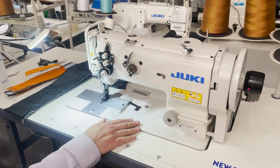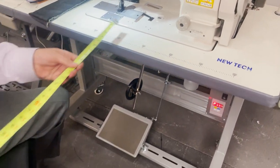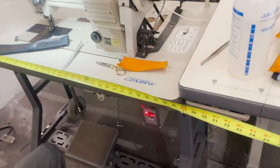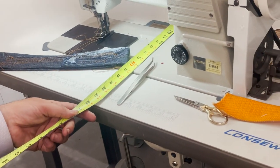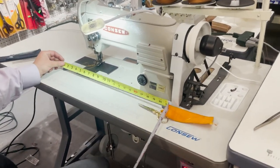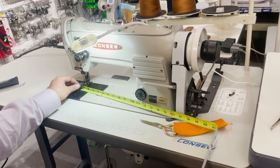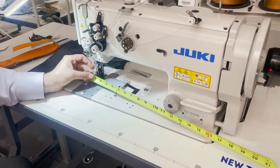The tables on both machines are the same size — 47 by 21 to 21.5, maybe 22 inches. The bed on the Juki is 20 inches total, and from the needle to the neck — what we call that inner area — is 10 inches. The Consew bed is also 20 inches with a 10-inch neck. Same dimensions on both.